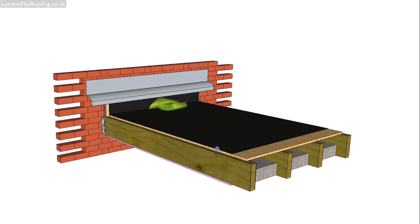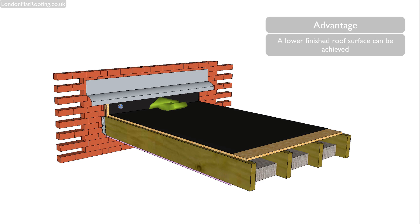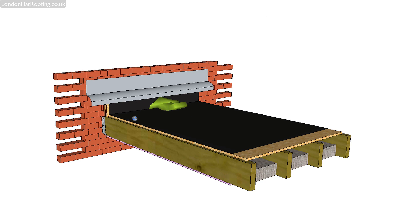The advantages of a cold roof are that it's not so high as a warm roof. On a warm roof, the insulation goes on top of all of this area and the roof covering goes on top of that. So the advantage is that it's not so deep in height. This helps when doing retrofit and some new build — if we've got door thresholds which run across approximately here and doors open out onto balconies, then we can save height of the ceilings of the rooms down below by using this system.